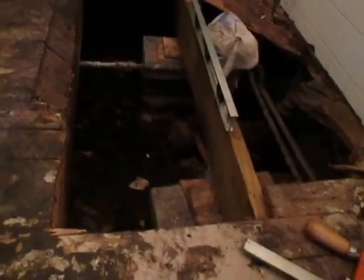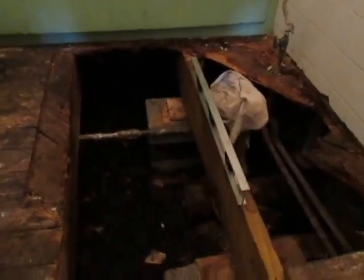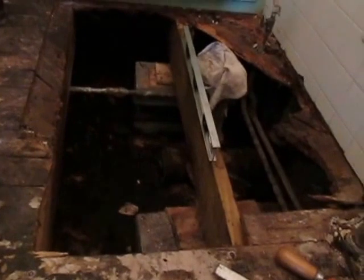Thanks to Billy coming over and helping me, that made it a much better, easier job. I need to run from this joist to this one and then over to the next one — run a couple of pieces that way. I need to square the hole up and I'm going back with pressure treated plywood, then cement board — I call it Hardy board — over the top of it. Then we'll be going back with tile, a much bigger eight-by-eight inch tile laid diagonally like what we used to have. With no low depression in the floor and sealing it up with treated wood, I think that problem is taken care of.